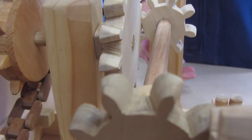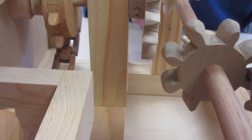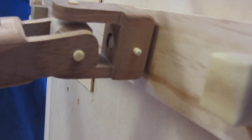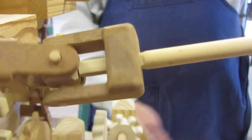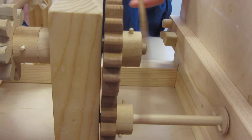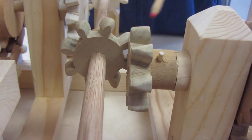The primary drive then goes to this setup only, but the other three are tied to this one with that black walnut chain. On top here, we've got a power takeoff off of this setup with the drive shaft. This drive shaft goes across, and that's what powers the elliptical gears. This side of the drive shaft is a standard U-joint. This side over here, we've got a slip joint so that drive shaft can slide back and forth. Down on the bottom here, we got a set of standard gears to drive the hands clapping. But that's powered by another set of 90 degree bevel gears.